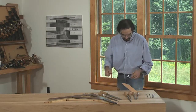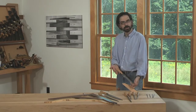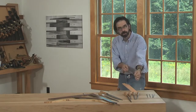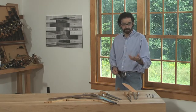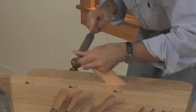The thing to remember as you get into use is that rasps are a two-handed tool. You grab the toe of it and then you grab the handle. They should only be used on the push stroke. If you pull and drag the rasp back over the work, that will actually prematurely dull the teeth. So when you use it, you just push forward.